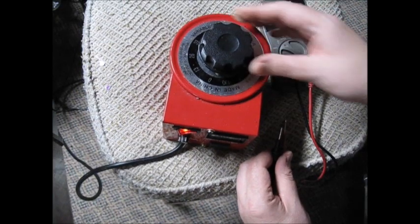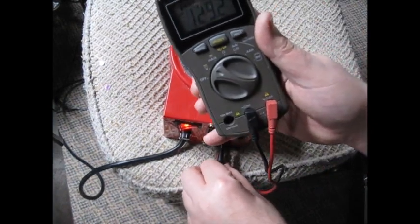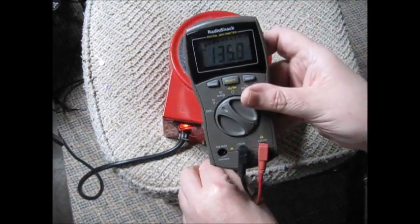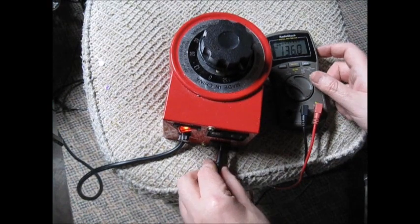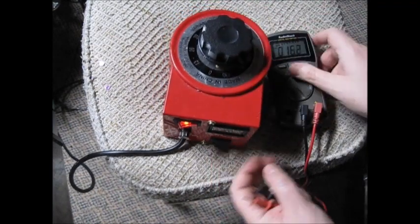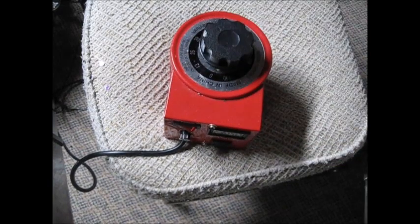That'll work perfect for our old vintage amplifier — wait, 130 volts, 129 volts. So if I put this up to 117 thinking it's normal house power, I'm getting 135 volts. I haven't blown anything up with this, but don't listen to the dial meter on a Variac. Put your own voltmeter — one you trust — on the input voltage so you don't blow up an amplifier. Customers don't like when things get blowed up. Keep learning.